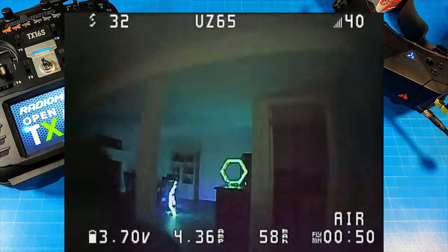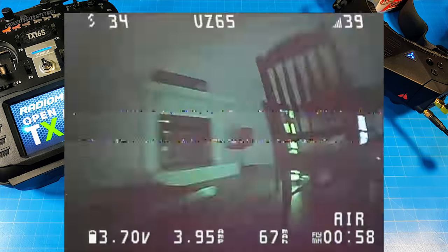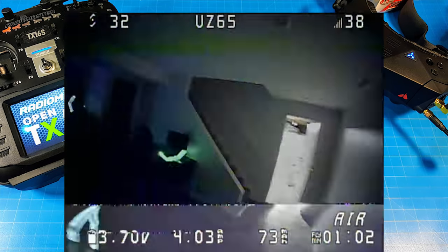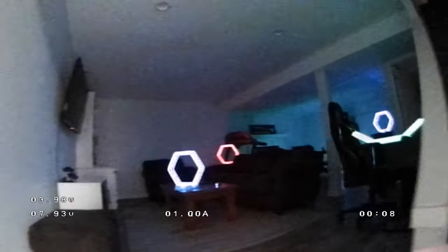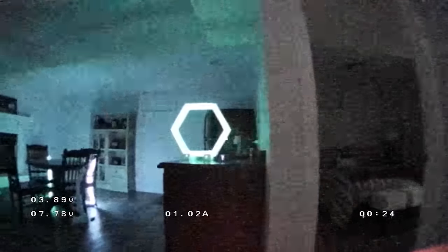You can see we've got pretty consistent flashing. I could probably help this by using a circular polarized antenna on the quad, though that adds weight. Back in my shop, I sit right next to the heating and air system with all that tin and metal. Whenever that kicks on, there's probably some electrical noise coming out of that machinery — that's just a suspicion. So we're going to fly out of the shop and go to the LED gates. When I passed through the gates in the goggles, I felt a kind of flash in my eyes, which I got used to. By the fifth flight I wasn't noticing it anymore — probably just something with the camera and the bright LED gates. Not a big deal, but worth noting.